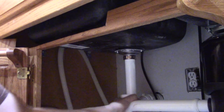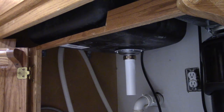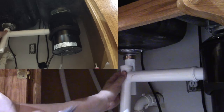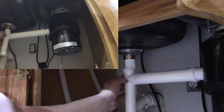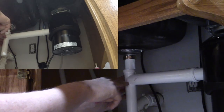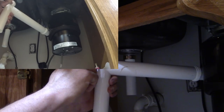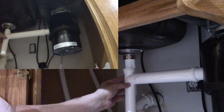It's almost too long — of course it's too long and has to be cut. This is where it's good to have a little Sharpie on hand. We're going to stick this end into the garbage disposal. We want a small downward slope going away from the garbage disposal so it always drains. This notch right here — this little lip — is as far as the pipe can go before it stops. So we're going to line it up inside the hole for the garbage disposal with a slight downward slope and then mark it.